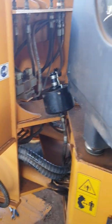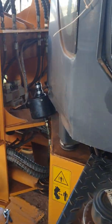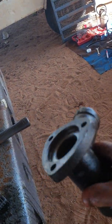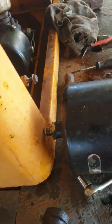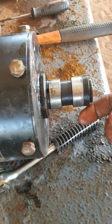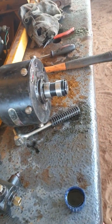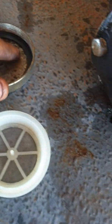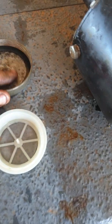Now we've got to go and clean up the rest of the stuff and get it all back together. Just when you're fitting this bit back up, once it's all nice and clean inside and ready to go, just put a little bit of brake fluid onto the seal here to help it slide in, and if you want you can put a little bit in the bore as well — just make it all slide together nicely. We've cleaned the reservoir up, looking a lot better than what it was. The lid was all covered in rust, that's all faded now, and the filter's all cleaned out.